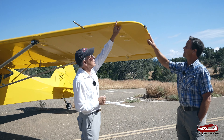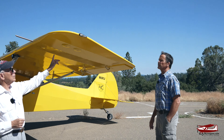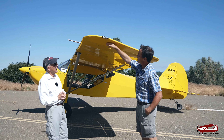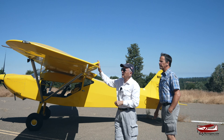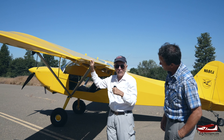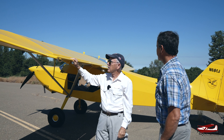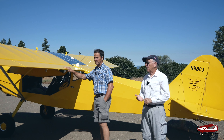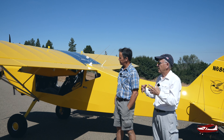The wing tip was our own design. The kit came with a big fiberglass piece that screws on, but we didn't want that, so we designed our own wing tip — fabric right to the tip. The ailerons are very light on the control because they're hinged well back — that's a Frise aileron. For flaps, we can get 10, 20, 30, and 40 degrees. Since we have electric flaps, we can set any flap setting we want.